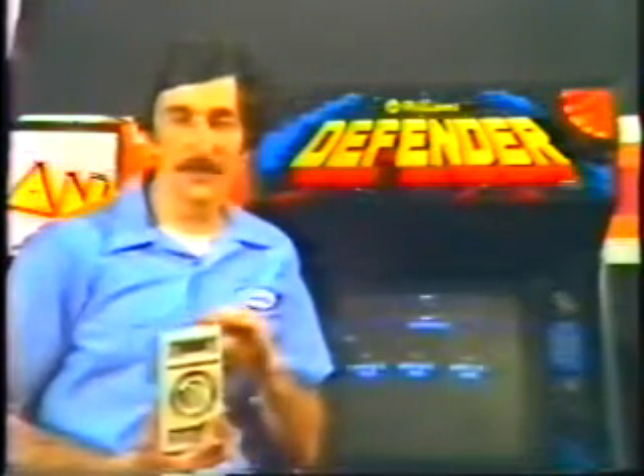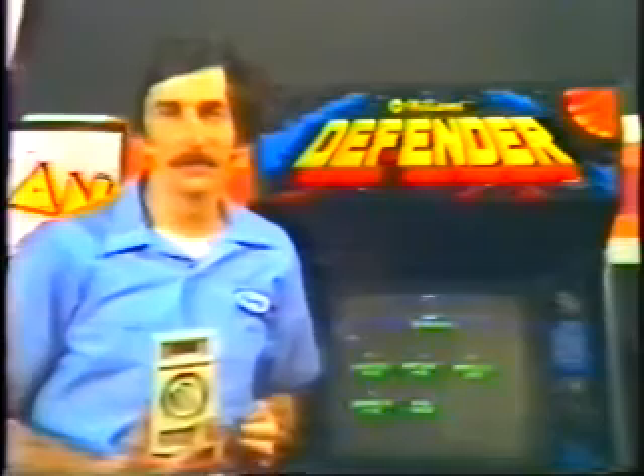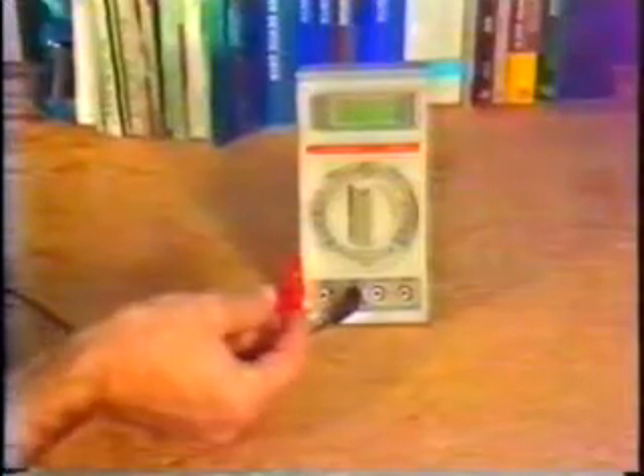Let's take a look at the voltage test and see how we measure voltage using the digital multimeter. Start the test by inserting the black meter lead in the jack marked COM for common. Our black lead will always be placed in the common jack. On the left is a jack marked for volts and ohms — that's where we'll put our red meter lead.